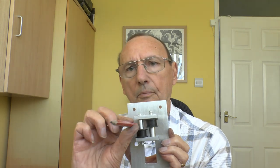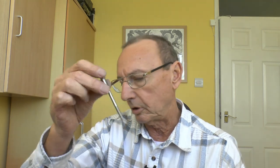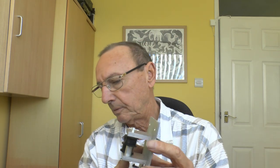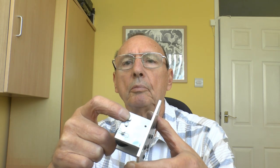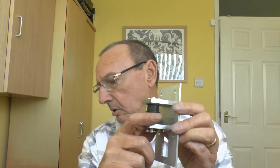You can see the belts will run in the middle — one comes in one side, one comes in the other, and they go that way, right in the center of the X-axis. On my existing machine I used bolts for the pulley shafts but they're stainless steel and quite heavy, so I made these little aluminum shafts instead with an R-clip top and bottom just to stop them from falling out. I turned up the spacers as well.